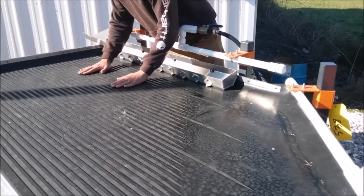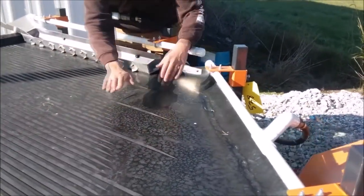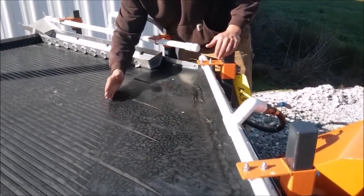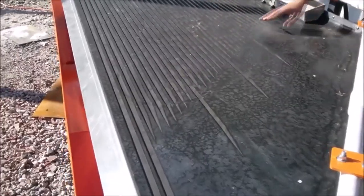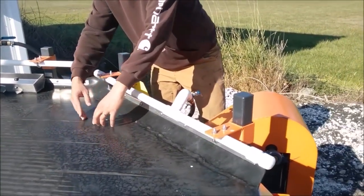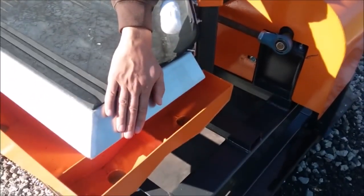Here is where the tailings would flow down into the tailings trough. There is a flat plane running diagonally at 45 degrees down the shaker table, and then a ramp built into the table top about a quarter inch from top to bottom. This allows the dense material to stay in the grooves and come up the ramp, while the lighter material — quartz, plastic, or other less dense material — stops at the end of the grooves and flows down into the tailings trough. Once the dense material is past the ramp, there are no more grooves, and the flat plateau allows water to wash away less dense material. The gold or heavy metals form a band right under the water bar and come down into the number one or number two ports.